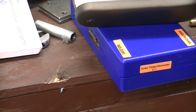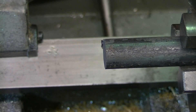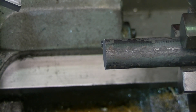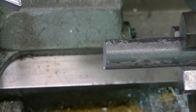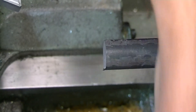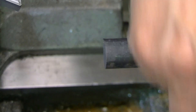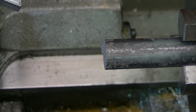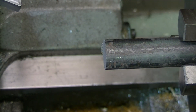I've got a piece of soft steel here — five-eighths mild steel, nothing special. I don't want to set it for threading yet because I haven't turned it down to half inch and got the gears set. So we're going to turn it down to half inch and then push straight into the thread with no compound, just to see how that comes out. I'm pretty sure I saw Bruce Whitman do that.